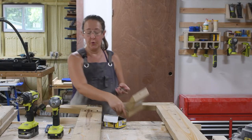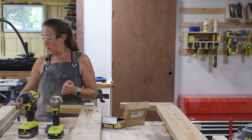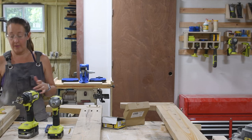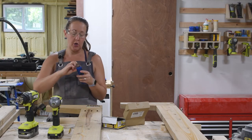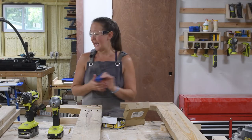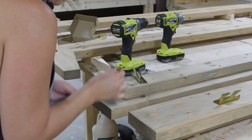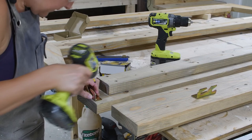To attach the bracket to the rail, make sure you're mirroring them — this one works on this side on the top so the screws engage when you drop it on, and the other goes on the other side. It's still three-quarters of an inch down from the top, and I use the Multi-Mark tool to measure the exact bracket thickness and set it in from the edge of the board by that amount to make sure everything is properly positioned. Then I pre-drill the holes and attach all the brackets.